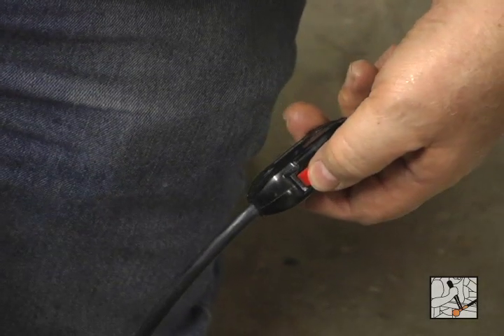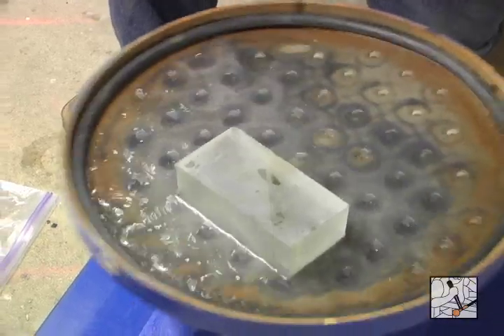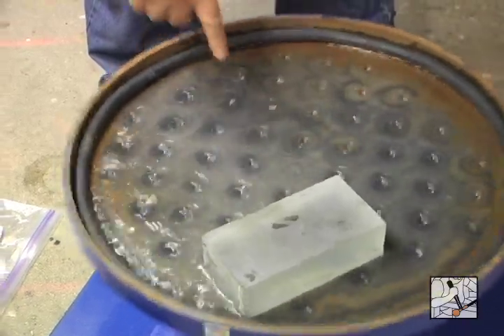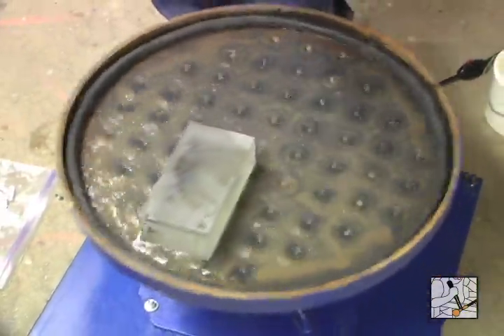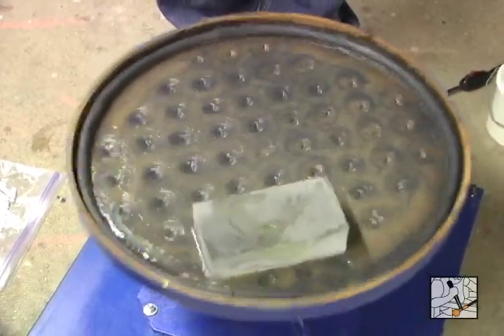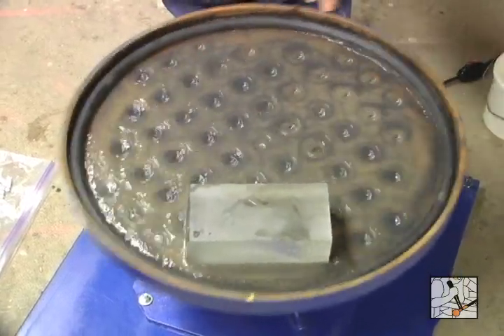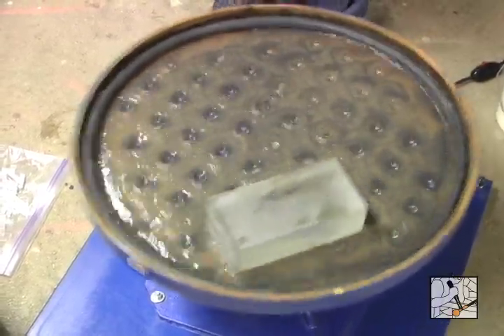I'm going to turn it on, so watch the glass. You'll see there's very little splashing. You can see the grit getting into these little cavities, the holes, the dimples, and the weight of the glass will do the grinding. If you need to, you can find a way to put extra weight on the glass. You can see the value of the bumper ring there as it moves around — keeps it moving on the pan. If you watch one little section on the pan, you'll see it actually slowly turning while it vibrates. It's reciprocating and lapping — Recipro-lap!